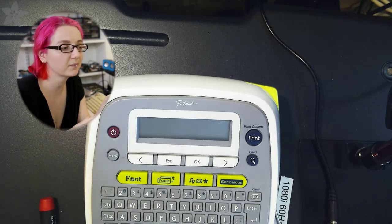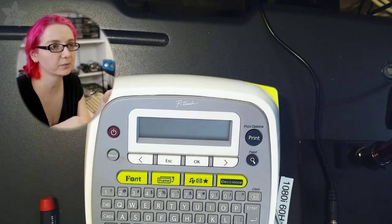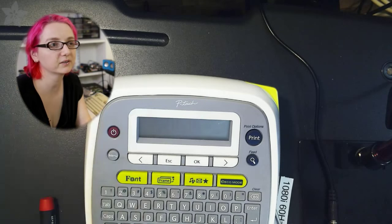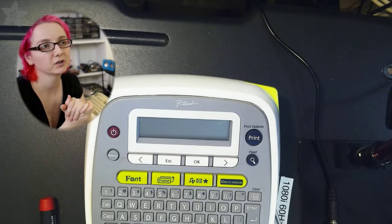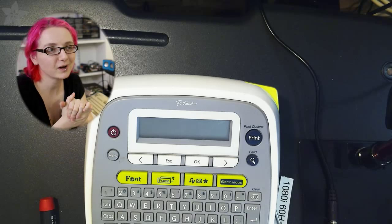Whereas if you're replacing something that used the big brick type, if you had a 9 volt adapter, it would easily be as high as 14 unloaded, and so those devices were designed to handle much wider ranges. It's a little risky. You can always try it if it's already broken.